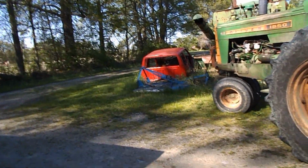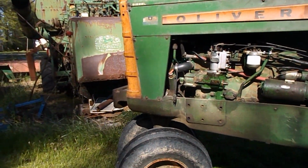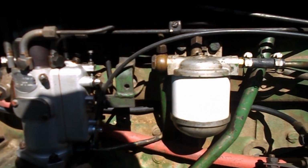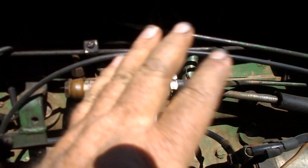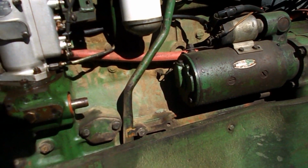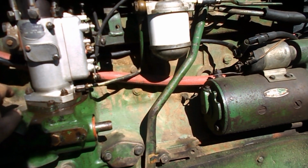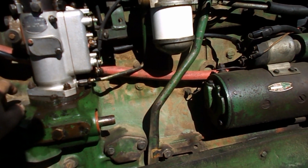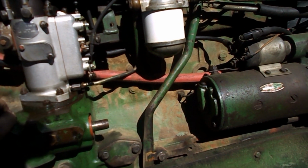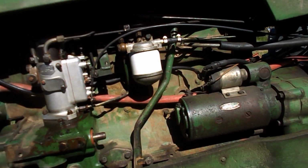I spent about an hour going over the fuel system. And once again, my injector pump was low, had air in it. So I went through all these lines, everywhere, and snugged everything up a little tighter. Because it doesn't have a fuel leak. It has just enough of a leak gap someplace where it's sucking air. So hopefully now that problem is solved and I don't have an issue now.